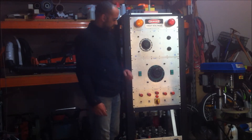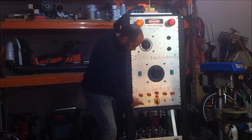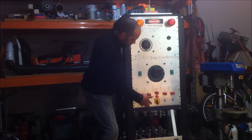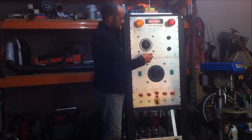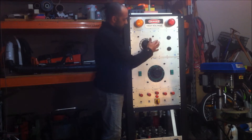That's very important for this build — that every circuit be lockable physically, mainly because of the fact that I've got young kids. I've also got indicator lamps on the control circuit for each of the variacs, and I've still got to put a few more holes into the phase panels for indicator lamps on the output side of the variac.